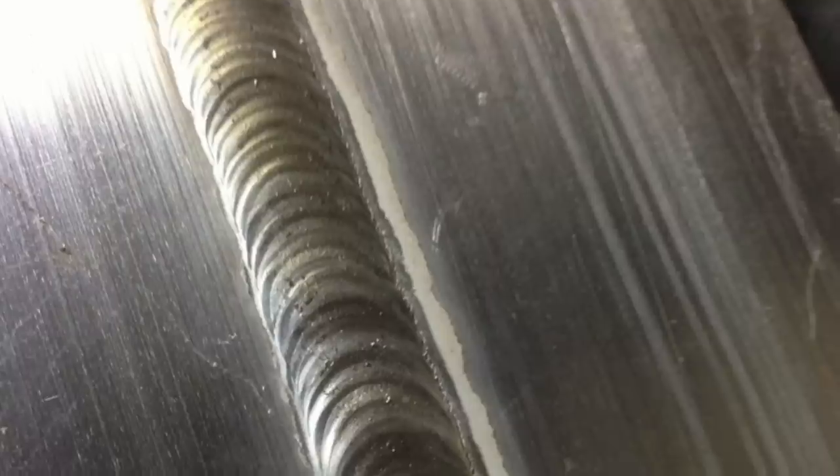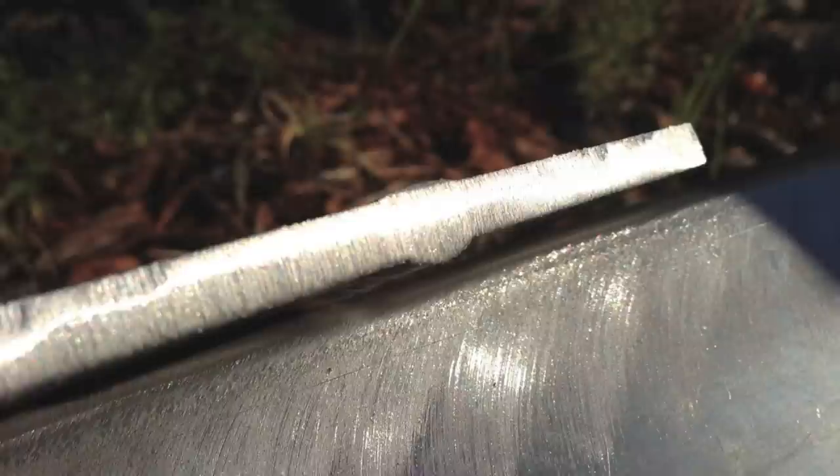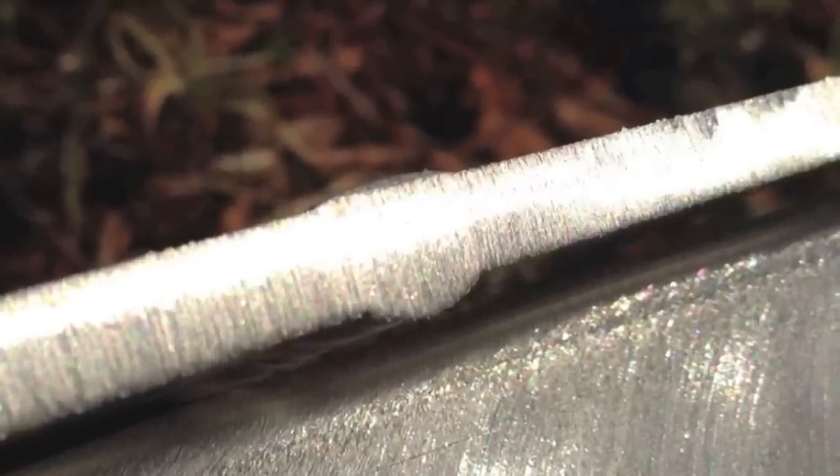As I get to the end, I taper out the amperage and add a little filler right at the end. The completed weld had a good appearance, and I cut it open with a saw to check that I had full penetration.